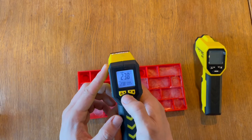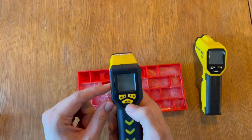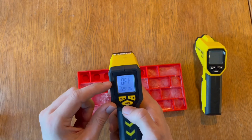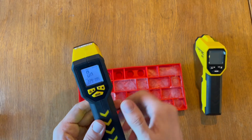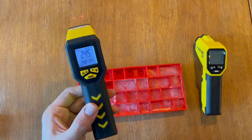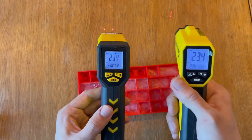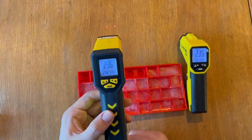When you go into the mode menu, there are quite a lot of things you can do. First, you can change the emissivity of the surface you're measuring — usually it's 0.95 for most things we measure, unless you need to be very precise. Then there's a lock feature. When the lock is on, it goes into a continuous scanning mode and will not shut down. It's a really good feature — very practical and handy.